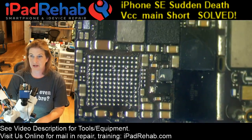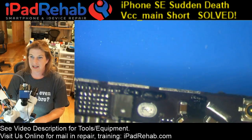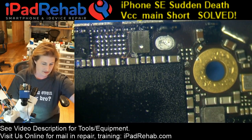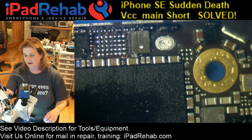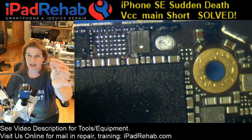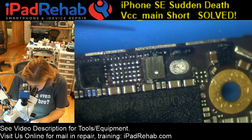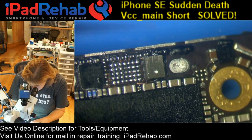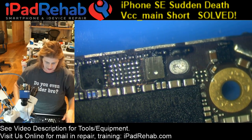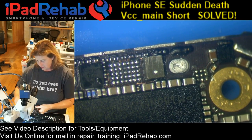So there you go. Now in order to get this board to boot, we're gonna have to put back on at least a Tigris. So let's get busy with that. And you can check out my brand new awesome tweezers that we're gonna be selling at iPad Rehab Supply. I really like these, super thin and super strong. So let me pick a little bit of solder balls. Let's pick that little bit of underfill that's left there while I tell you about my adventures with this cat.